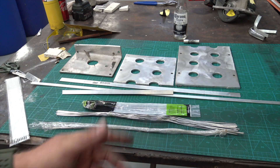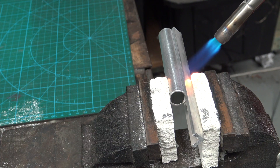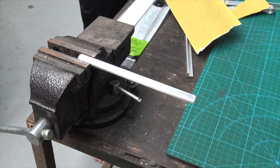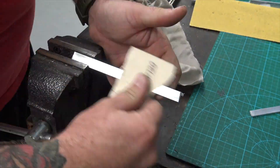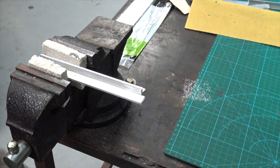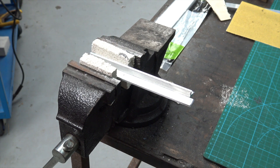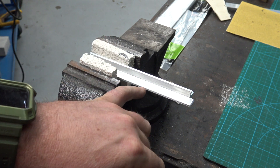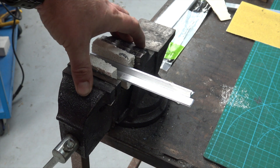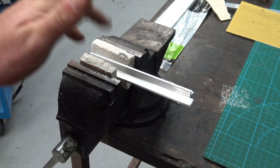Based on all the feedback, here's what I'm going to do differently: I'm going to insulate the workpiece from the vice to make sure it doesn't become a massive heatsink. I'm going to use the torch on a lower setting, and I'm going to step up my weld prep. Last time I just used the flap disc; this time I'm using wire brush, sandpaper, and then acetone. I've got two off-cuts of refractory brick from our mini forge project to keep the vice from being a heatsink, and I've got the aluminium pieces wire-brushed, sanded, and chemically cleaned ready for welding.